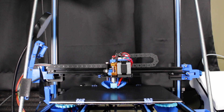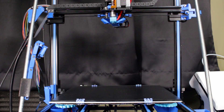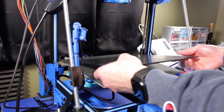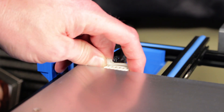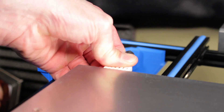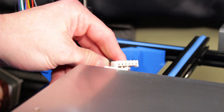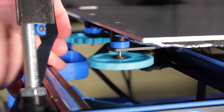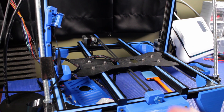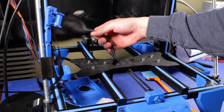To start, I like to move the x-axis up and out of the way. First I'll remove the build plate. This is the connector for the heated bed — I'll remove the zip tie that secures the wire to the connector. This is a very delicate piece and you want to be very careful when you remove it; it's very easy to damage the pins. Now I'll remove the leveling knobs and the heated bed itself and set it aside. I have the bed wire zip tied to the y-axis carriage to help prevent any strain on the connectors. It's attached to the y-axis stabilizer, which I'll show later.